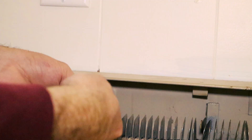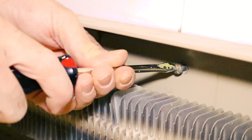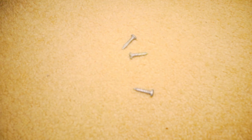Now there are these little screws all the way down the unit — just unscrew those to remove the old heater. When you take these screws out, you'll see they're up here and down at the bottom — that's exactly where you'll put them back in on your new baseboard heater. Also pay attention to the size of the screw; these give you an idea of what was already in there. The instructions recommend wood screws, so find something just like what was used.